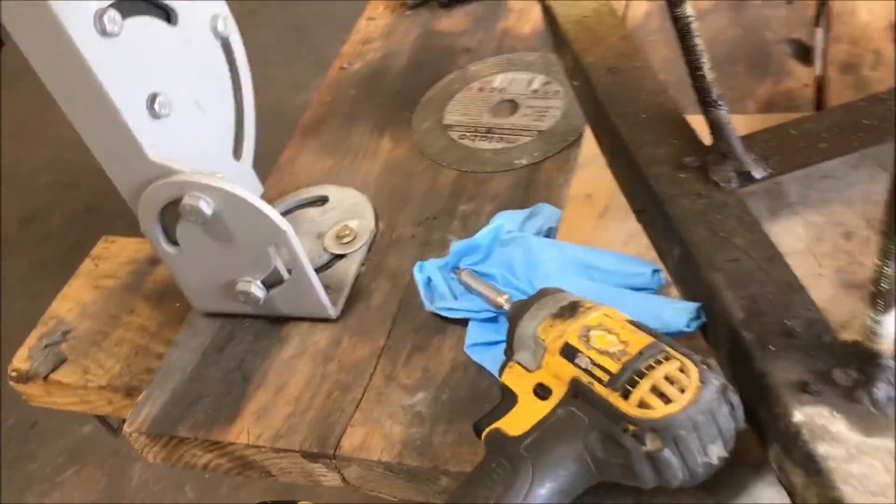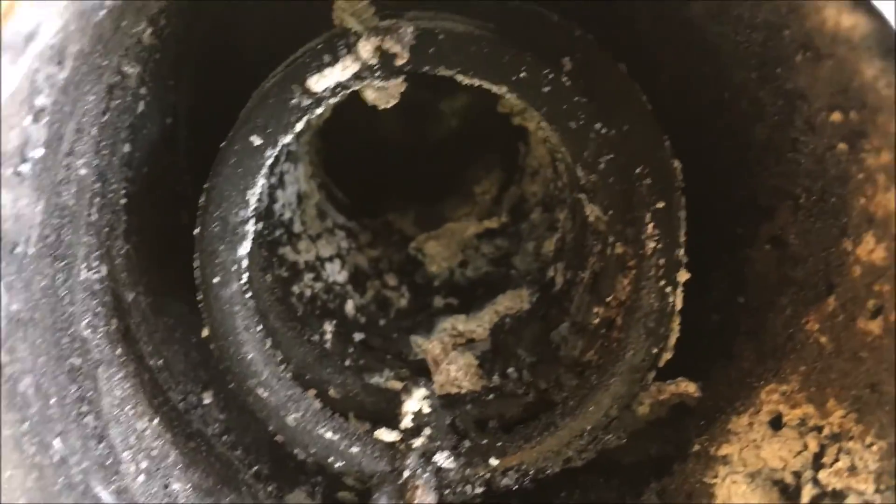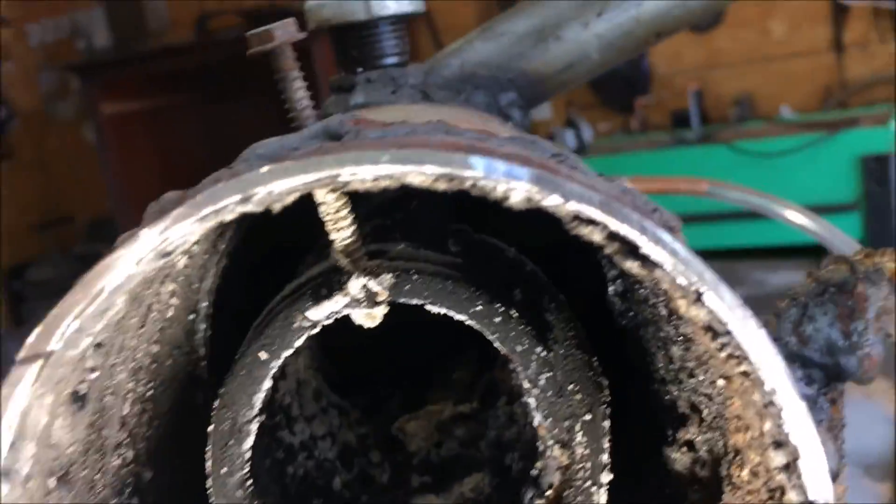I can't imagine what 100 gallons would do. So if you ever build a waste oil burner and have plans for it operating over extensive periods of time, you're going to have to design it so it can be easily cleaned. Beating on this with a hammer might have cleaned a lot of that out. I'm going to extract this vaporization coil and take a better look at it — it seems somewhat clogged. Hard to see in there.